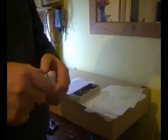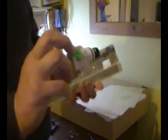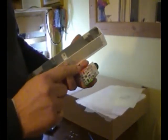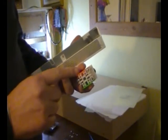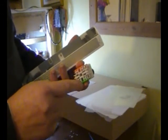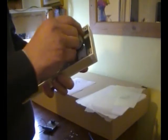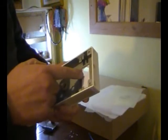It just seems incredible to me that they can do this. Now we're going to put the stop button in. It doesn't matter which way round you go because the orange is the normally closed contact, which is the stop button section, and you've also got a normally open pair of contacts. I just cut the hole out with a pair of scissors — very scientific engineering equipment, but it works for me.